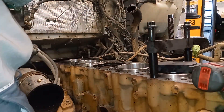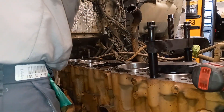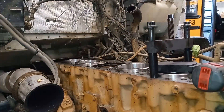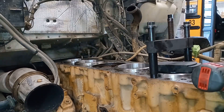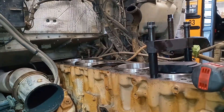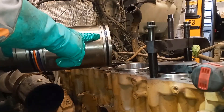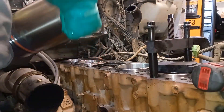I use tire soap in a body wash bottle — I find it works really well because you don't have to pour it out, it just squirts out with a few presses on the top. I prepped the liner by putting tire soap on the o-rings and soaking and installing the filler band. Note that you have a short amount of time once you get oil on that filler band to install the liner.